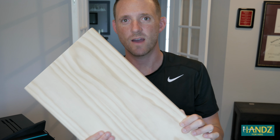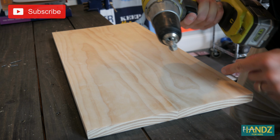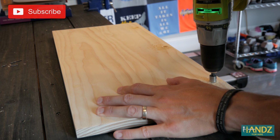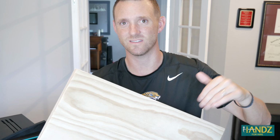We've sanded, now we're almost ready for staining, but before we do that, I wanna drill the three holes in here. These are the holes that are gonna attach the shelf to the windowsill. And I'm also gonna inlay the three screw holes so that we can put a plug over them. When I put the plug in, I wanna sand the plug down, then pop the plug out, then we'll stain the whole thing, and then we'll pop the plugs back in after it's attached to the windowsill.